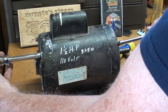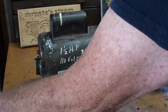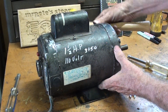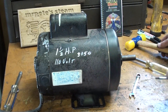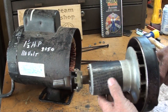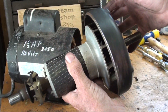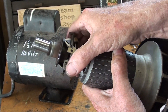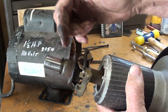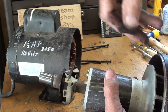Okay, let's get it apart. And there's the whole rotor — maybe you call it the armature. Now I've got to get the end bell off of there; that's of course the part of the centrifugal switch, or the centrifugal mechanism. If there's any washers here, do not lose them, because those are spacer washers, and you must reassemble it the same way so you don't have too much end play.